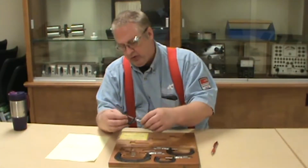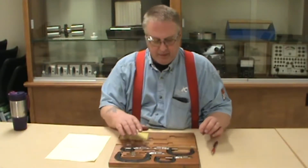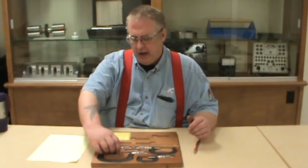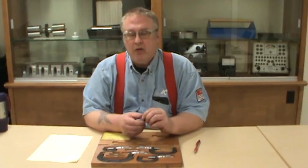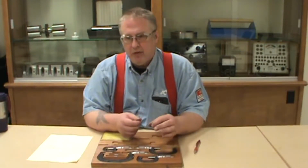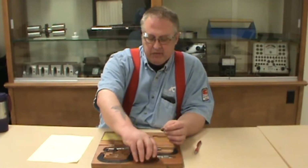I can give you a little war story on this while I'm getting out the standards here. I had a former student who owned a shop, and one day he had to leave rather hurriedly from class, and I never understood why until he came back and he explained to me. They did a high pressure compressor for the gas industry, and when they got the part to the job site way out in the middle of nowhere in Kansas, it didn't fit. Well, when they checked, what had happened was the machinist that made the part had not calibrated his micrometer, and the part was about 3/1000ths of an inch undersized. So that was kind of a bad thing, but it was a good lesson to learn.